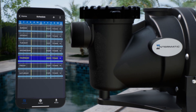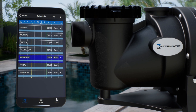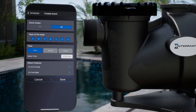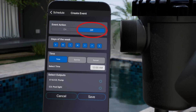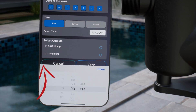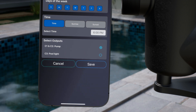On the weekly view, you will see a continuous line since an On event has been set without an Off event. To fix this, press the plus button and again choose Basic Scheduling. For this event, we want the pump to turn off, so we will leave Off selected. Again, leave all days of the week selected. For time, click in the box and scroll to select 6 p.m. Again, select the pump as your output and then click Save.